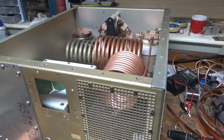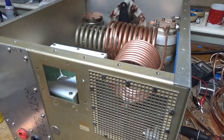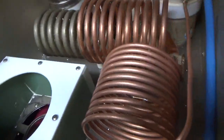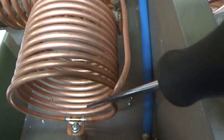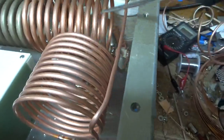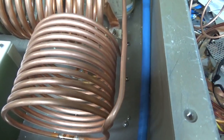I got the 160 meter coil in, paralleled the contacts on the band switch, and tapped the 160 to 80 meter coil junction back to the band switch. I added a 160 coil, put a standoff on either side — I might put one in the middle also — 2-inch tall standoffs. I took the 1-inch wide copper material, wrapped around, soldered it, punched a hole, and used the ceramic standoff, one per side. This is a little over 10 microhenries — about 10.4 — so I can actually spread the turns a bit to knock it down.